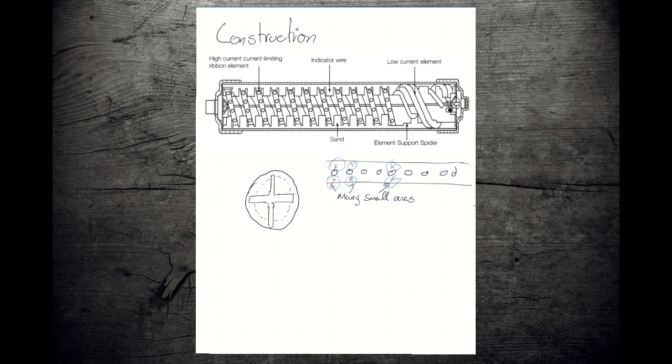And so what you end up doing is where before you had, this might have a resistance when it's in good shape of 1 milliohm, it starts to burn and the fulgurite starts to form, and all of a sudden now it's 1 ohm, and then it's 10 ohms, and then it's 1,000 ohms, and then it's 1,000,000 ohms, and then it's 1,000,000,000 ohms. And so what it does is it ramps that resistance right up very quickly as time goes by.